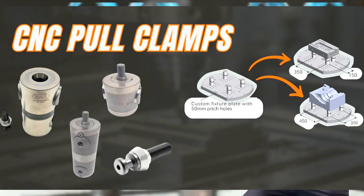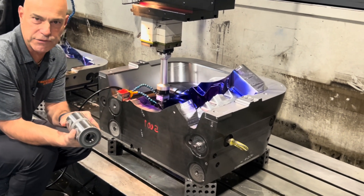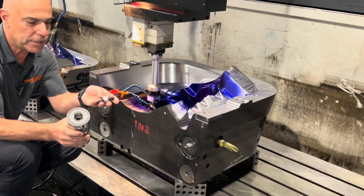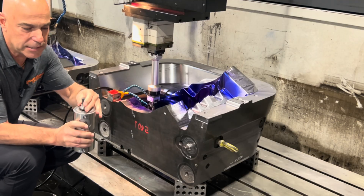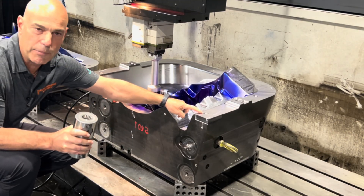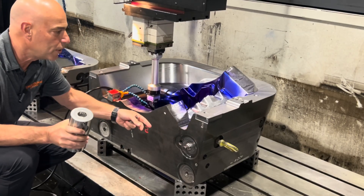As for these faces on the front — if you've seen some of our other videos — we use these hold downs, which are great. They're compatible with Schunk or FCS and basically bolt the blocks to our table. We put these spigots into the blocks and that's how we bolt them to our CNC machine — not only for the bottom or top of the blocks but also for this particular side mount application.